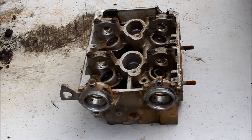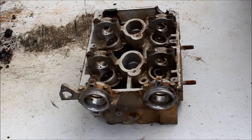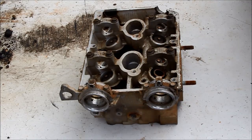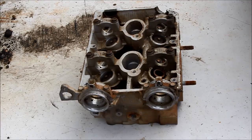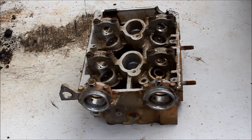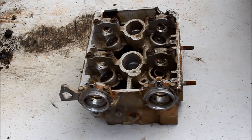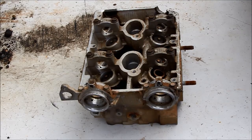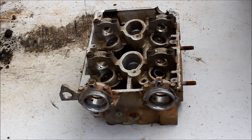The victim of today's furnace melt is going to be a cylinder head off a Subaru flat-four boxer engine. This is off a two-litre normally aspirated, and the thing is stuffed. It was on an engine that was severely overheated. What happens is the heads go soft, the aluminium loses its tension and you can never torque them down again to properly seal. So before anybody starts telling me it could have been used — no, this thing is only good for exactly what I'm going to do with it: scrap it.